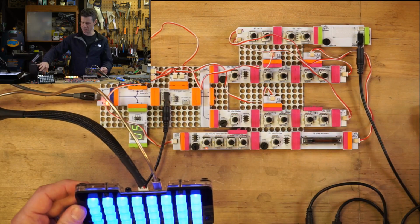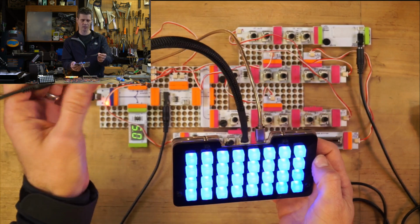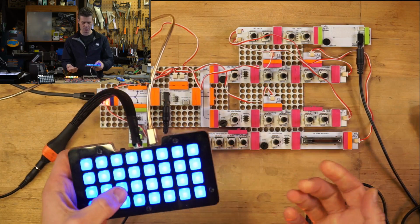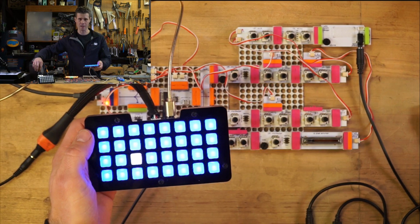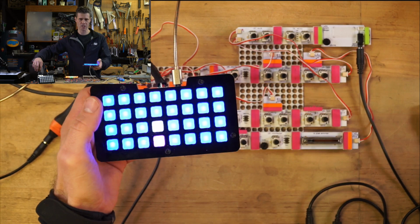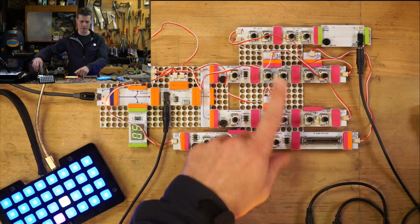So there's a little bit that will read in classic MIDI. And I've got a little cable here I built. This is one of our STEMMA to male connectors going in through our little phono adapter and then running over the TRS cable. So let's start this up. And I'm going to turn this down a little bit. What I'm running is the arpeggiator program that Colin Cunningham wrote. And he recently made some additions to it, which are super cool, being able to hold these arpeggios. And then while that's playing, I can kind of set that down and twiddle the knobs on the synthesizer, which is always a lot of fun. So let's goof around with cutoff a little.